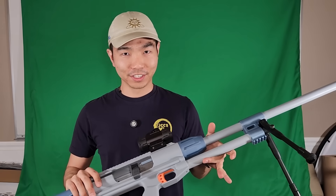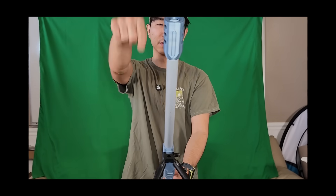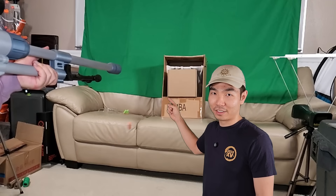As we can see, this thing is just not very consistent. I checked for air leaks. I changed out the muzzle in case there's a muzzle obstruction — here's the new one. I got rid of the little lip. I even cleaned out the barrel — that's much cleaner. But none of those things actually improved the situation. The real culprit is getting a consistent gas fill on this shell, which turns out to be pretty difficult. There's nothing I can fix here.